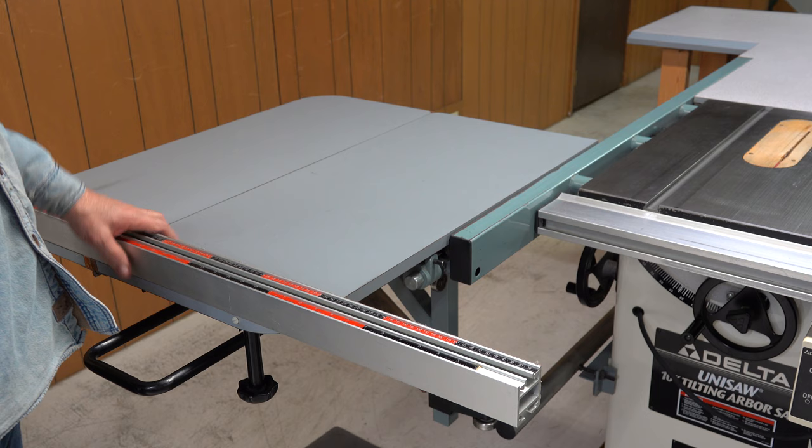Now, standard fence, add a piece of hardwood, a little bit of sandpaper to the front, you are set. Right? But you have a little bit of slop. Sometimes that'll kill you if you're building stuff with a lot of pieces. So they came out with something like this. And this will allow you to break up into half a degree increments on either side. So you can literally break up 180 degrees in half a degree increments repeatedly.